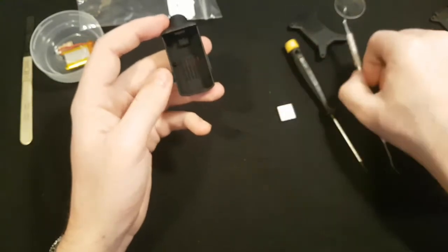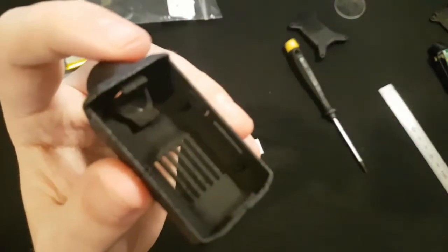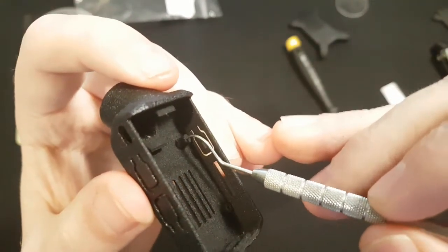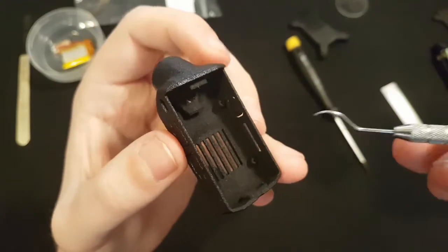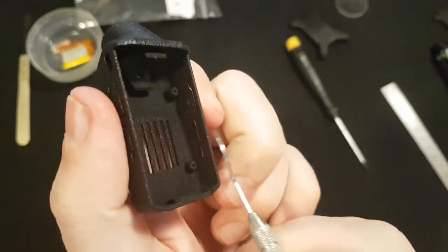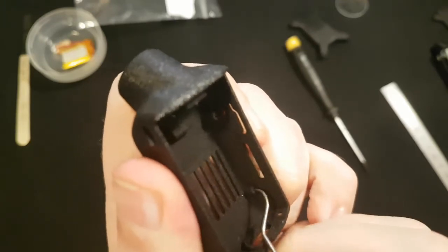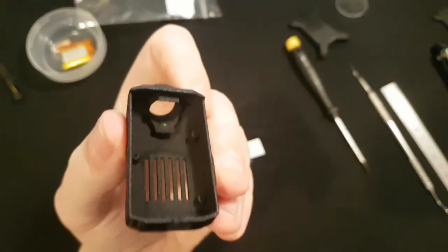Let's play with putting the board into place. Best way to do it is first to do a little bit of case prep. These screw bosses here — I do give these a quick clean-out before I send each case out. The way these are printed is in a bed of powder and then a laser comes around and melts that powder, creating a very homogenous material, much stronger than a traditional FDM or the type of 3D printing you see people doing in their bedrooms. Quite often these little holes can have a bit of that powder left still in them, so I do clean them out — but if you want to double-check it, it's always better to be safe than sorry.